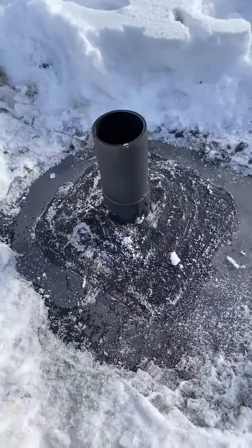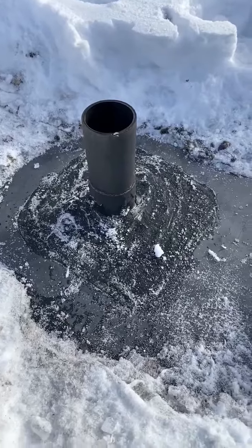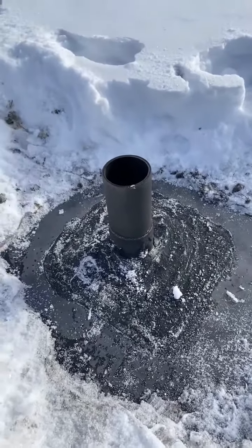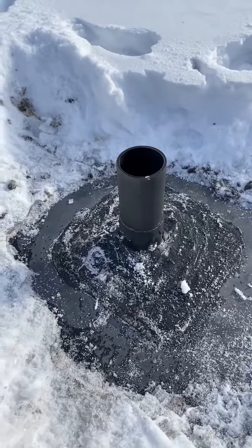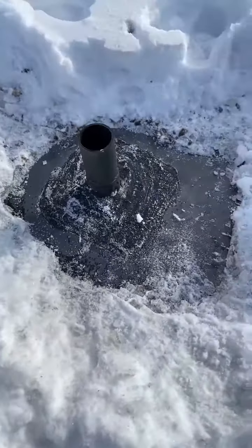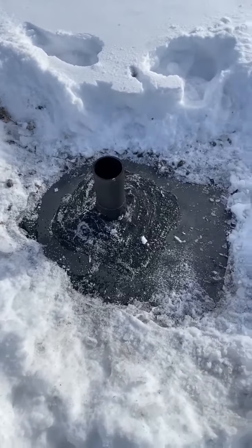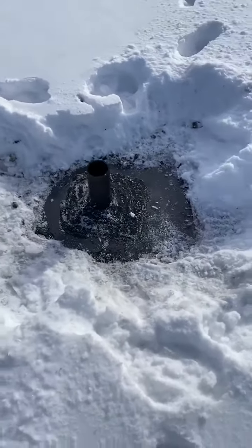What I'm seeing here — I dug it out — somebody put tar on this roof. You never want to put tar on a rubber roof. What happens is that tar is going to dry the rubber out and it's going to start cracking underneath. That tar is not going to hold up. You want to flash this with a proper pipe flashing boot, so we'll get him set up in the right direction.